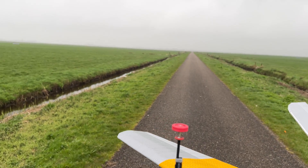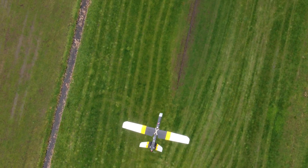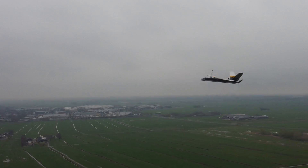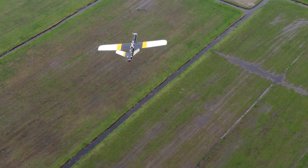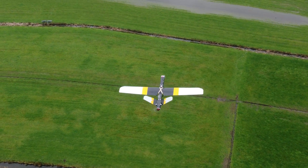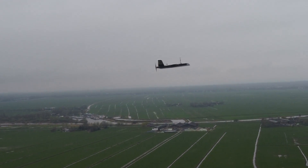Comparing the two post-flight stats together, I can bring two things together: weather conditions and efficiency. My conditions this time were so much worse — wind conditions were similar but this time I had rain, drizzle, fog and everything with it, which makes it much harder for the plane to do its endurance flight. It still managed to be more efficient at 150mAh per kilometer and over a 2-hour flight time in the worst possible weather conditions, which leaves the question of how much better it'll perform in optimal conditions — almost no wind and a sunny day. So there's a third and final endurance flight attempt with this particular V-tail pusher design to see how much potential it actually has with its current setup.